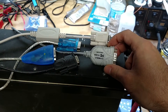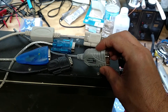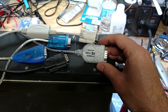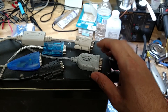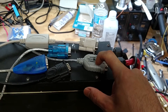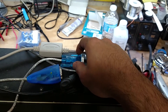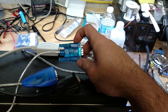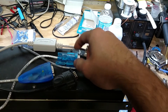I've used this Prolific one for about 10 years or so and it died — it's really not worth cracking open trying to fix it because it's probably just got one chip in it. It's made by Dynex but it's got a Prolific PL2303 chip in it, and that one had worked for a long time with no issues. When it died, I picked up some cheap $1 USB to serial adapters that claimed to be Prolific 2303, because I knew that one had worked for years with no problems.